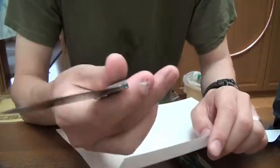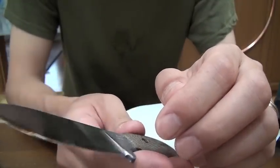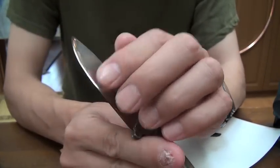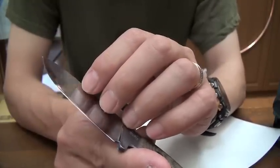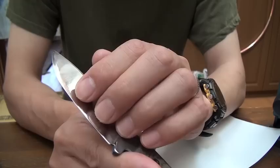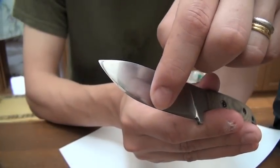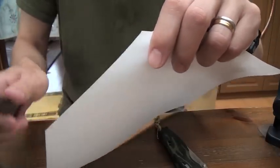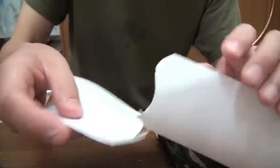For this sharpness, I added a steep convex blended to save time. If I did full convexing, it would take 5 hours. However, it took me just 2.5 hours because I saved time by blending a steep convex on the edge. The shining part, the very shining part, is the steep convex blended. So it has practical sharpness, however, not razor sharp.